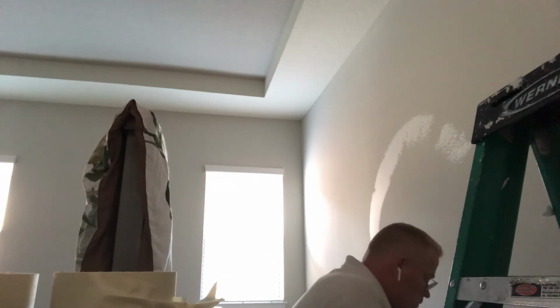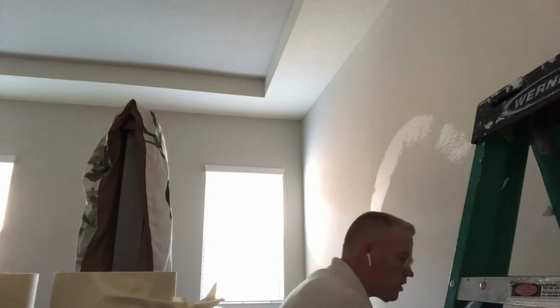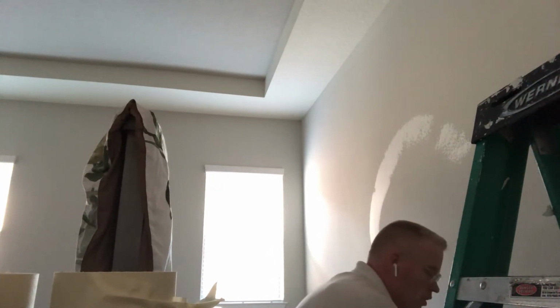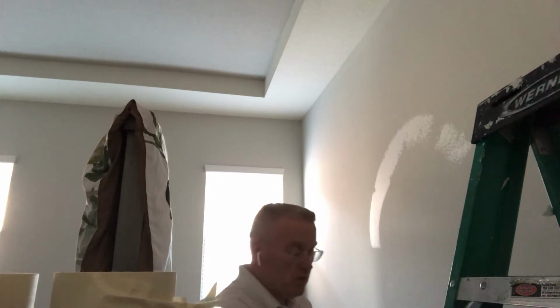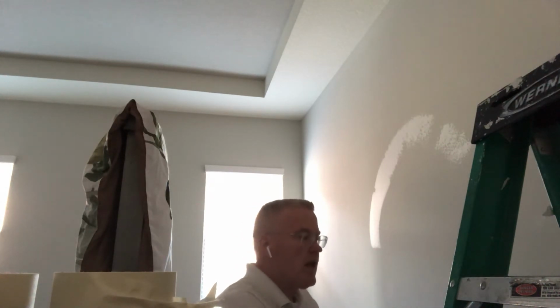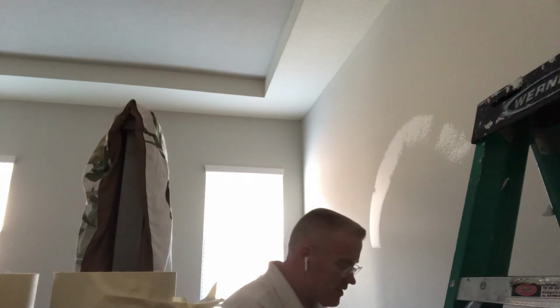Secondly, you want to decide whether or not there's a couple of ways you can apply the mixture onto the wall. You can dip a roller with which you paint walls into the bucket and then roll it on the walls. But in that case, you would have to have a far looser consistency than the one I'm using right now.